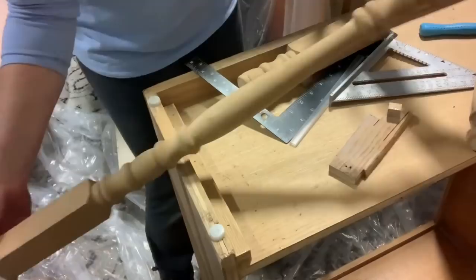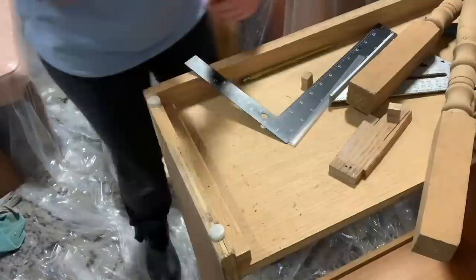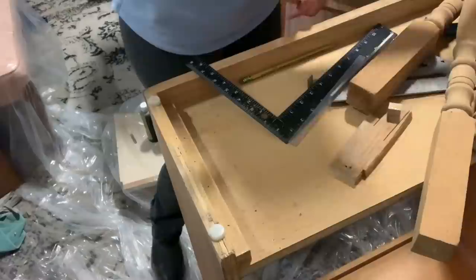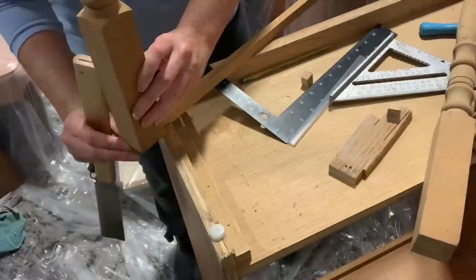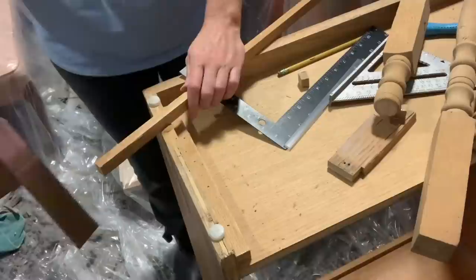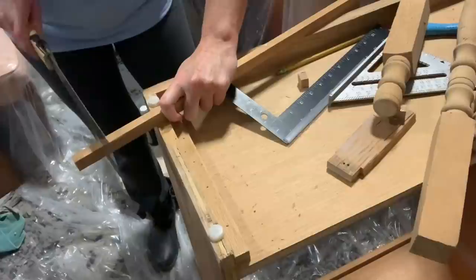Here's the fun part — we're going to build a base with stair balusters. Anytime you can find these things, pick them up. These are larger ones I can use to make the legs on this piece, and I've got smaller ones for legs on smaller pieces. This was a box of free ones somebody was just getting rid of. I also keep little strips of wood on hand at all times. Since you can see the little glue block down at the bottom of the shelf, I needed a larger surface area to glue the balusters to, so I'm cutting it to size to fit the width of the baluster. I'll glue it into the section that was missing there. I'm using pocket holes and glue to make sure these legs are super sturdy.